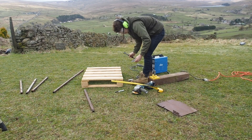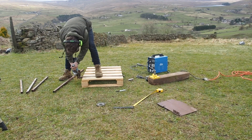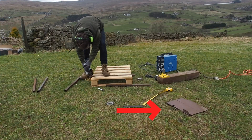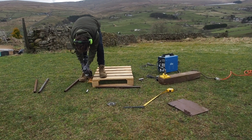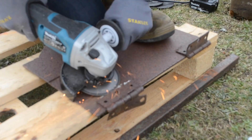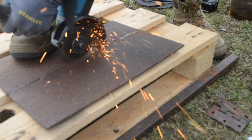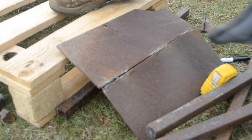I don't have a workbench or anything like that, so I've decided to use some recycled steel. Here we've got some old square tubing off a metal desk and a bit of flat steel plate which is 5mm thick — off an old oil tanker. All I'm going to do is take the four lengths of square steel, weld them together as an upright, cut the steel plate in two, weld half to the top and half to the bottom, drill a couple of holes and bolt it down to concrete. Then fix the bender to the top and I've got a nice little stand to work with.